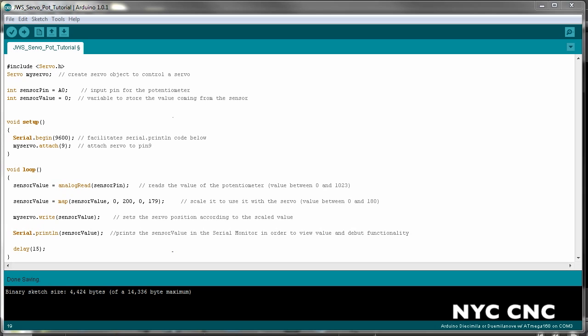If you noticed in the beginning of this video, a small rotation of the potentiometer resulted in the servo rotating a full 180 degrees. In other words, it acted with much greater sensitivity. We achieved this by tweaking our map function parameters. Traditionally, you would use the full range of the potentiometer's input — in other words, 0 all the way to 1023. To make it more sensitive, simply replace the 1023 with something like 200. This means that rotating the potentiometer approximately one-fifth of its range of motion will result in a full 180 degree movement of the servo.